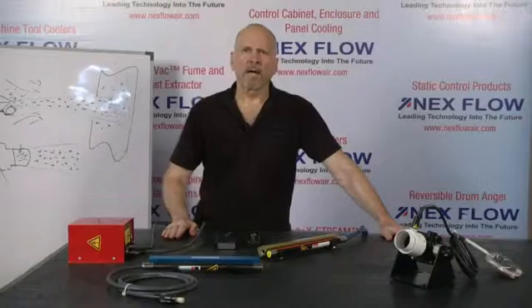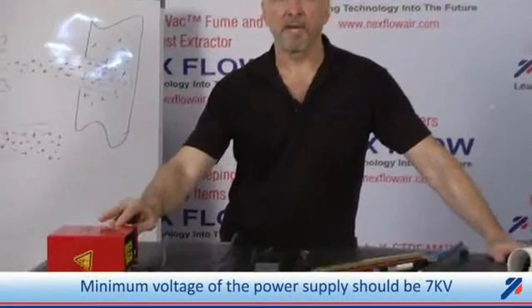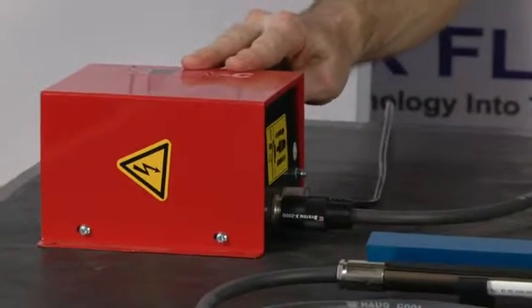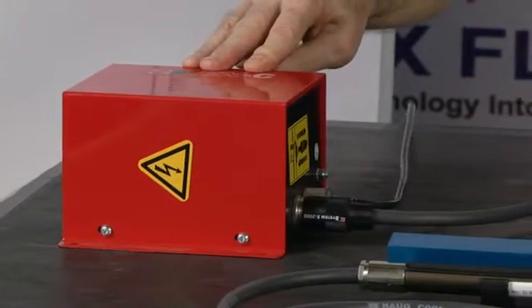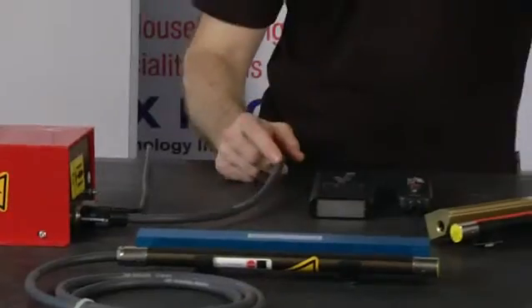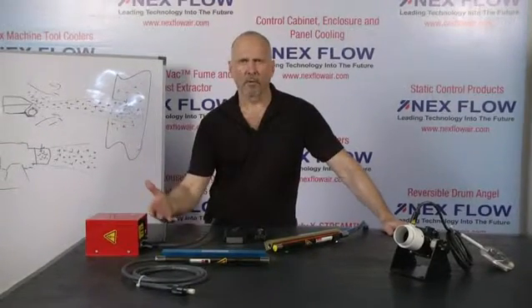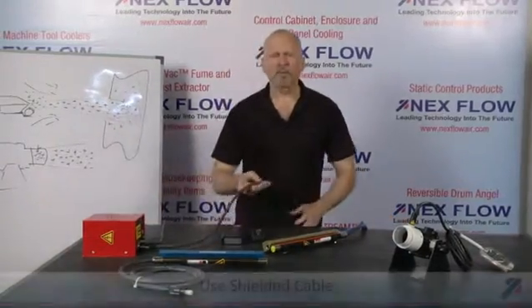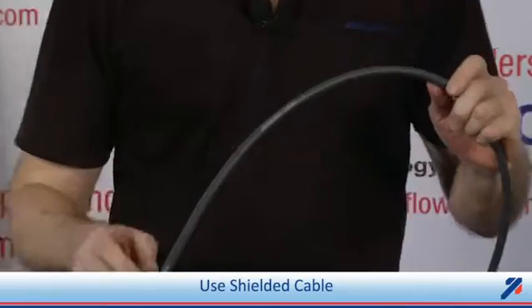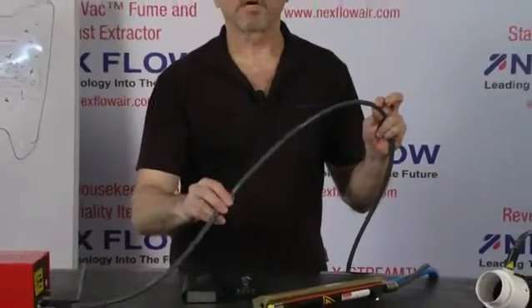Every static device requires a high-voltage power supply to work. It is a good idea to have a minimum voltage in your power supply of 7 kV, which is what Nexflow always uses. A supply of say 5 kV will not last as long, simply because transformers wear out over time, and the cable that delivers power to the static device draws away some voltage. As the transformer wears out, it can drop below the voltage you need, and the device just stops working. In our case, it lasts much, much longer. So minimum 7 kV is very important. We only use fully shielded cable. If unshielded cable is used, it has to be offset — otherwise you get grounding and earlier destruction of the device.